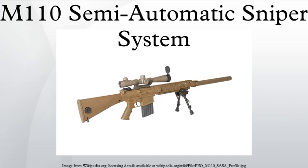According to Performance Specification with Amendment 1, October 5, 2009: 3.4.1.1.1 Accuracy. The distance between the mean point of impact of each shot group, both unsuppressed and suppressed, shall be not greater than 1.1 inches at 300 feet. 3.4.1.1.2 Dispersion. The average mean radius of each shot group shall be not greater than 0.68 inches at 300 feet. All targets shall be fired on using M118LR ammunition or equivalent, using 5-round groups.